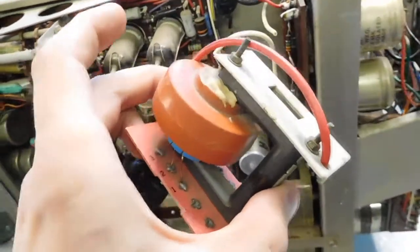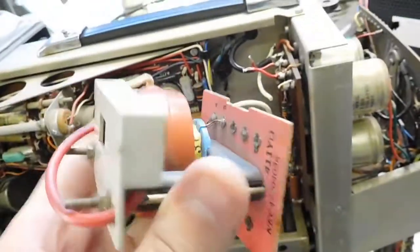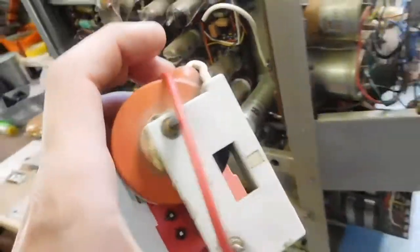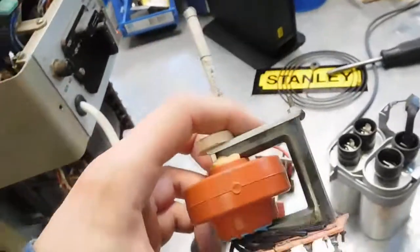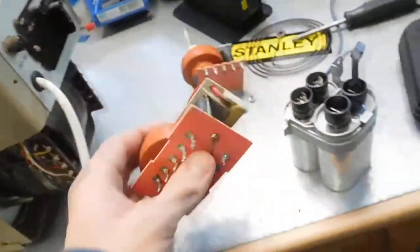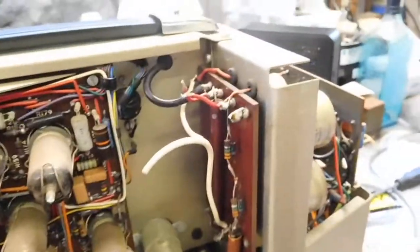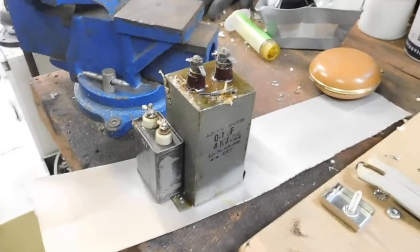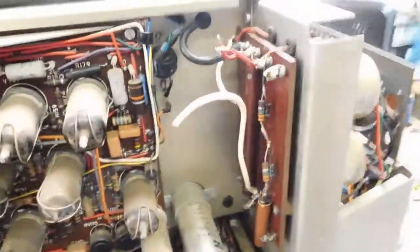Option B is to rip all that out completely and put an old AC flyback transformer in with a diode to convert it to DC. I just need to work out the pin-outs, what's feeding it, and what the voltage is, then rig something up and drive the EHT with that. I've got two transformers here out of old black-and-white televisions — they're in immaculate condition for their age. They'd even fit in the gap there. You can still buy oil-filled caps, but I don't want to put PCB-filled capacitors in something like this — I'd rather completely eradicate that problem.